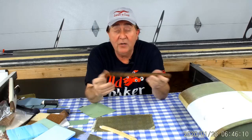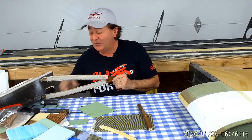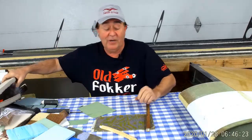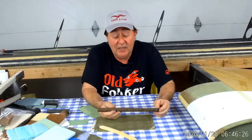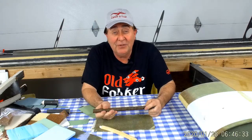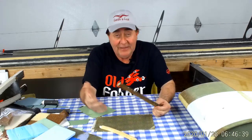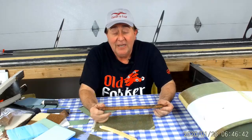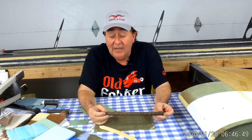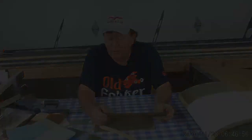All the ribs had no vertical or diagonal bracing — just an upper and a lower — and some ribs were close to five feet long. They worked fine, they didn't need any vertical bracing. They're velcroed to the skin so they can't go side to side, and they carry the loads because I've tested them. That's really the key to all of this: as I walk into areas where people haven't been before or I can't find data on, I literally have to spend the time making a boatload of samples and testing them to figure out what will work and what won't.